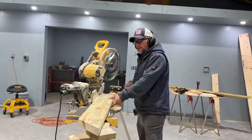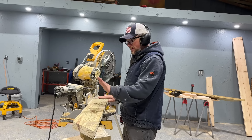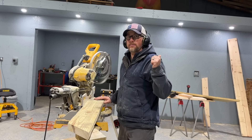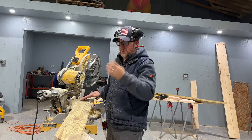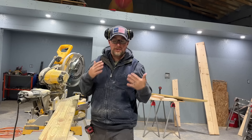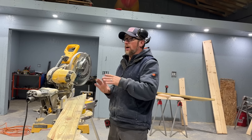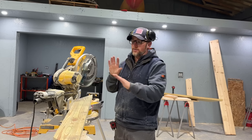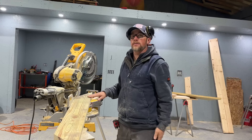All right, let's test fit this one first, and if this one is right we'll cut the first one to put up. We'll put the first one up, then we'll check our second template. This is going to be built in three sections. The reason I'm doing them out of two-by-sixes is it's a lot easier to cut them and put them up in sections than cutting them out of a six-by-six. If we cut them out of a six-by-six, I'd have to notch them in to recess in on the two-by-ten. By doing it with two-by-sixes, I can build it in sections — the short one and then the longer ones on the inside.